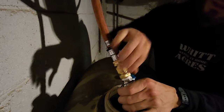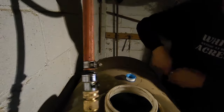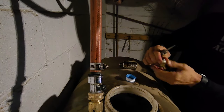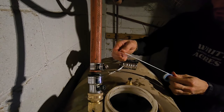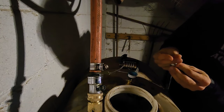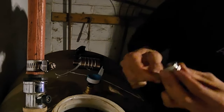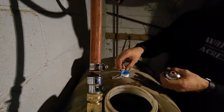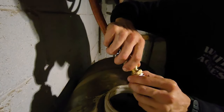I'm going to shut this off and disconnect it at the point that it's leaking. That's the piece that's leaking and I can't get it apart easily. Alright, the first time I just wrapped the tape around flat, so I'm going to pull all that off. The trick I saw is to take a piece and twist it into a ribbon that you can fit into the threads — put this into the thread, then go around with the flat tape on top. Let's try this again — put it in the quick connect. Still leaking.